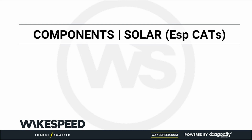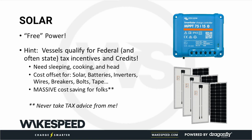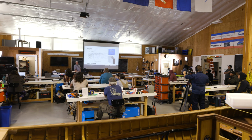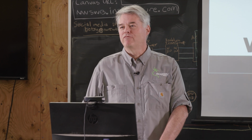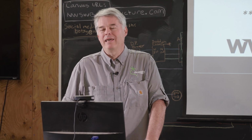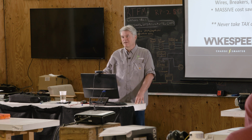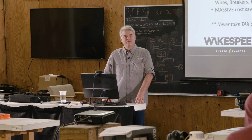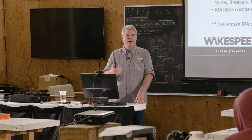I want to talk about this a bit because even though I make an alternator controller, solar panels are a really, really viable technology these days to apply to boats. I mentioned that on Viking Star 2 we've got 480 watts worth of solar panels. I'm not one of those guys that's going to go out 4 times a day and adjust the panels to point them to the sun. I'm not the guy that's going to worry about the optimal angle or the shadowing coming over from my derrick boom. I just don't worry about it. I got them mounted flat, and I got them up to a controller, and guess what? They provide probably 80% of our electrical usage from about May through July.